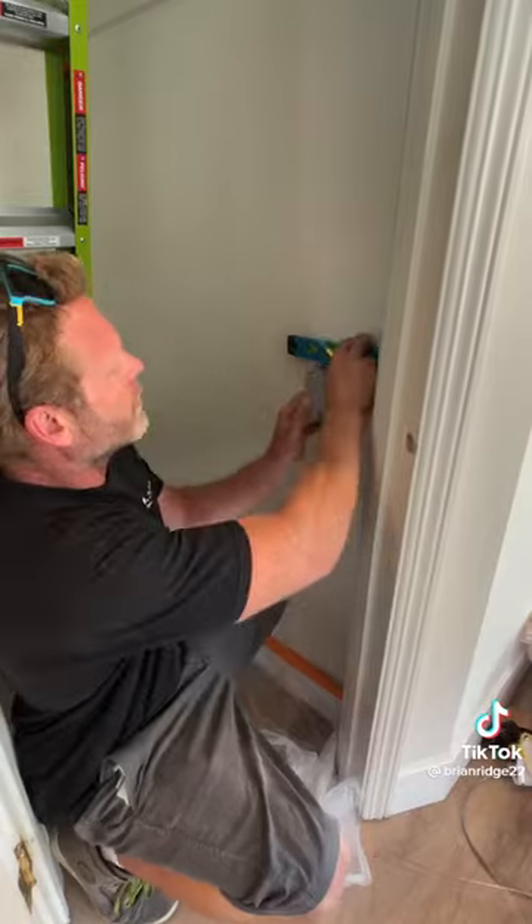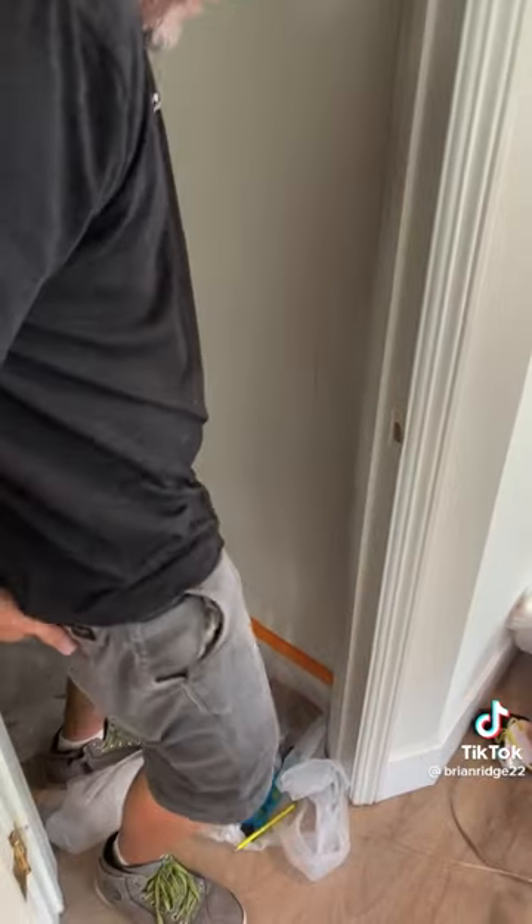After I cut out my switch and my fixture box, I'm going to get power from this junction box in the attic. So I'll drill down through the top plate here and then I'll run my wire to my fixture box and my switch. I got my box traced out in the stucco and now I'm going to cut it out with my drywall saw.